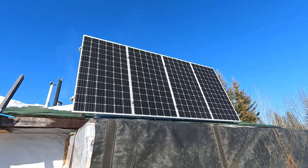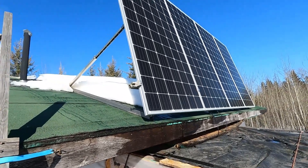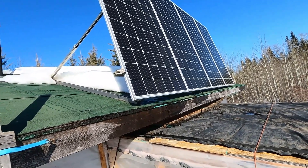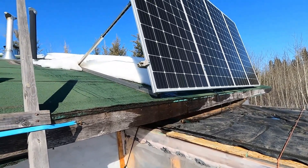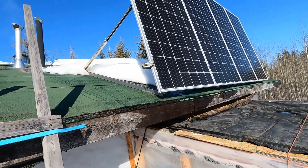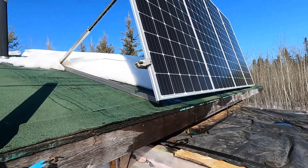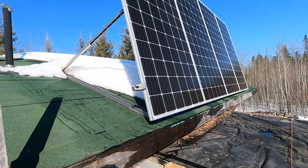Solar power — expensive or not? I've had a lot of questions about my solar. Of course, it's winter time, but I put this up here just about 10 years ago. I had a different setup with some panels, but this has been up for quite a while. I got a good deal on some panels — these are 24 volt panels, 340 watts each, and there are four of them. You don't need a lot of panels to put up a nice system that's not that expensive. Put your money into batteries because you need the storage.